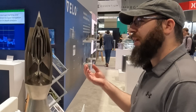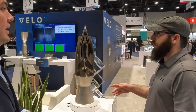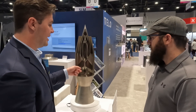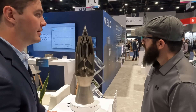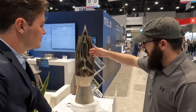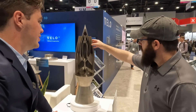The bleed air injection also reduces the parasitic drag on the engine. Is it kind of like an internal afterburn type setup? No, it's just air, not fuel. You're basically reducing the pressure drop from the leading edge of the flame holder to the trailing edge — so less drag. So you have supersonic air come in, you slow it down, you combust it, and then you get way more force coming out the back. That would be the thrust you're generating with the engine.